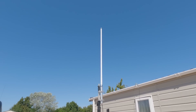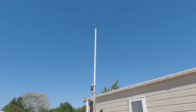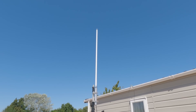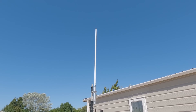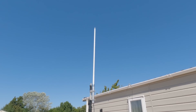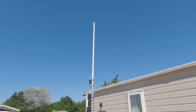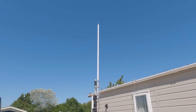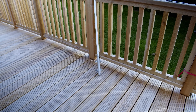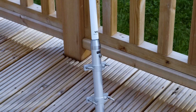I've mounted this VX30 on top of a telescopic fiberglass mast and you can see how sleek it is. The antenna covers two bands — two meters and 70cm — handles 150 watts, and the VSWR is very flat. The resonant point seems to be around 145 MHz, but even at the bottom of the band at the SSB end you're only going to get about 1.2:1, and it's similar at the top of the band around 145.9 MHz. It's a very flat response antenna, and very neat and weatherproof.